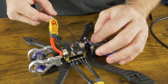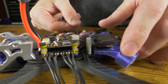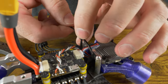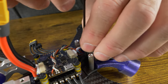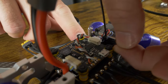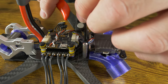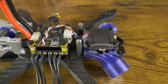Put the zip tie underneath the antenna for the RadioMaster receiver and grab all the wires going through in that zip tie, bunching them all together so none of them end up in the props. If the antenna tips up or down that's fine — it's nowhere near the propellers and if it points up at an angle it's not a big deal. Snip off the zip tie and now all wires are bundled and safe inside the frame.